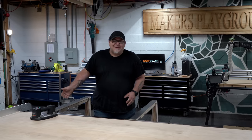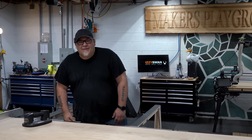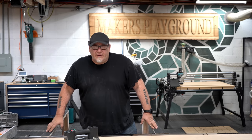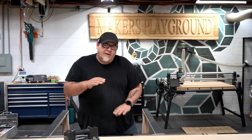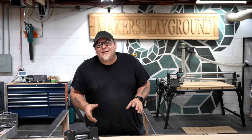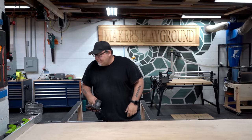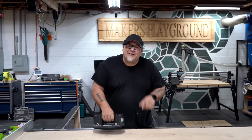You can adjust them as needed, get in between them — there's nothing not to like about these. I can't thank Jay enough for sharing this on his YouTube channel. That's really what it's all about: sharing experience, knowledge, and building cool things. If you'd like a set of plans, I'll put a link in the description box. One thing to note: the plans are designed for a table saw with a height between 33 and 34.5 inches, so make sure you check your table saw height before you start building and add or subtract length to the legs as needed. If you need me, I'll be in my shop playing with my new table saw infeeds. Have a good one and we'll see you in the next video.